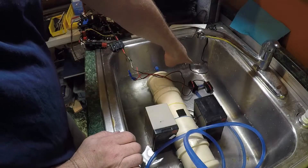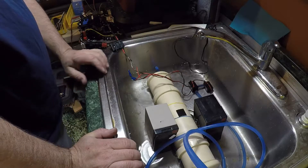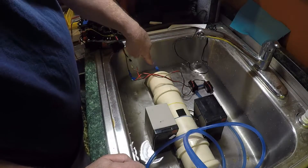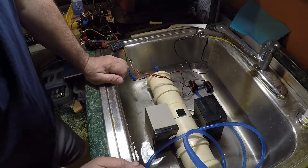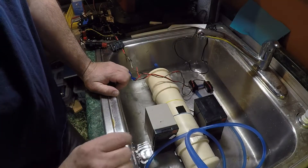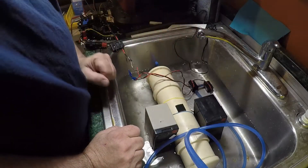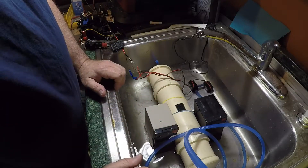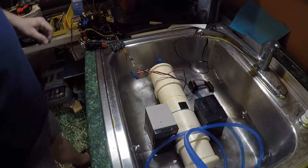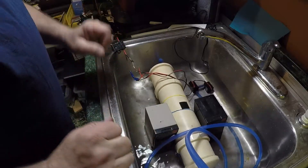You can see the water coming out successfully, pulling it through the inboard pump. Drawing 12.16 volts, 0.25–0.26 amps, 3.1 watts again. This system was originally designed by Skip. It lends itself better to larger boats where you have room for two pumps and running gear, but you still have a gas backup to blow should the model get into trouble. She's fully blown — you can hear the motor.